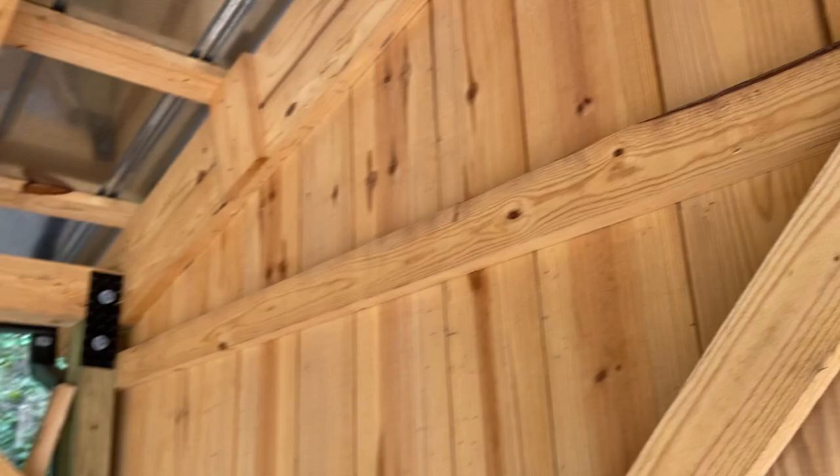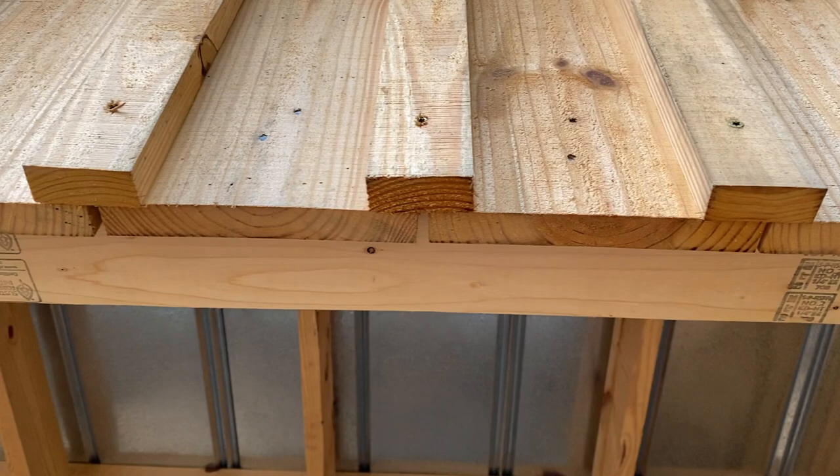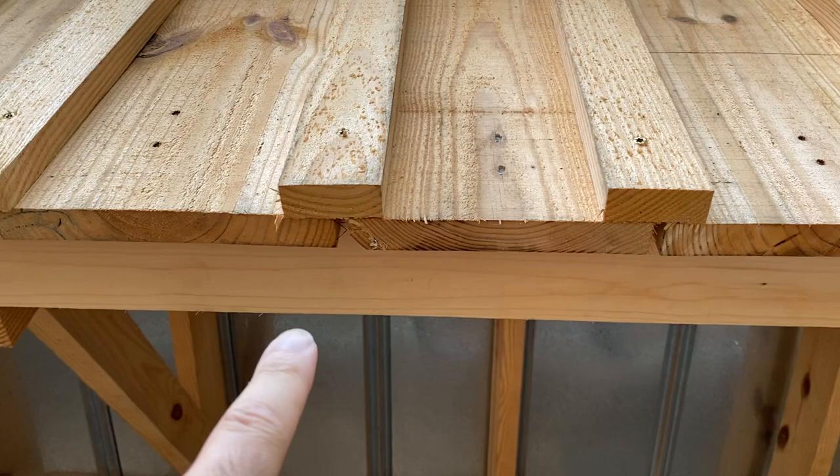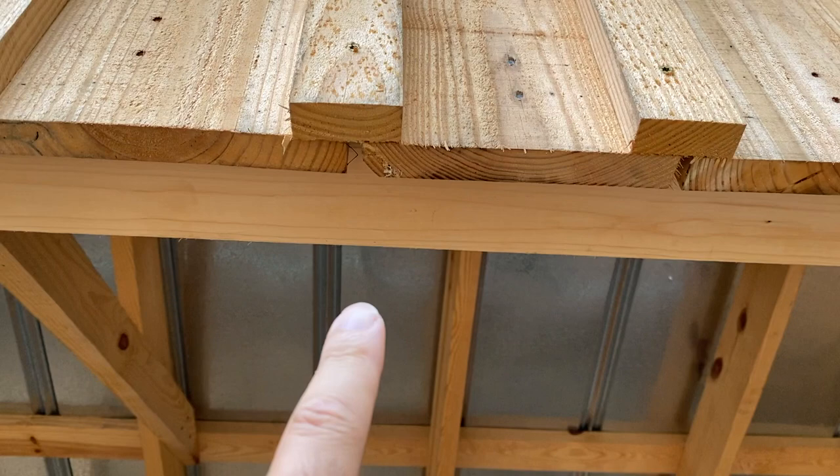Over here we've got some really big gaps — about 3/8 of an inch wide — but that's to be expected. The board and batten method worked like it's supposed to: we have substantial shrinkage but no splitting or cracking, and you don't see any daylight in the gaps because the batten is still covering up the joint. You can get a better view up here at the front edge, where you can see the boards and battens with the gaps behind the battens — substantial gaps, but they're not a big deal.